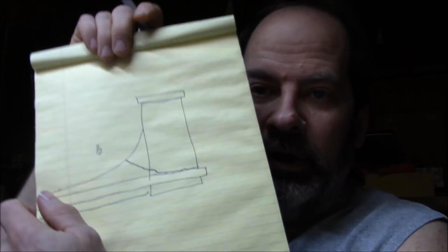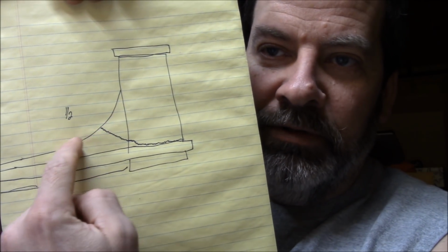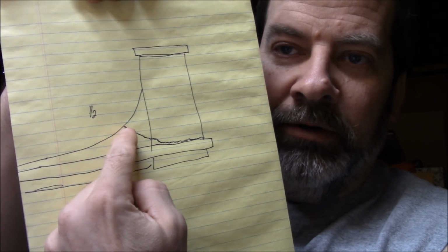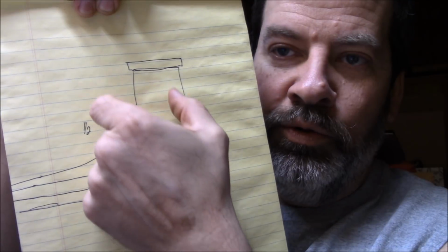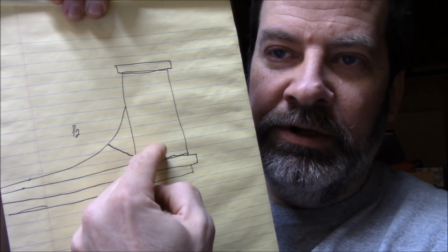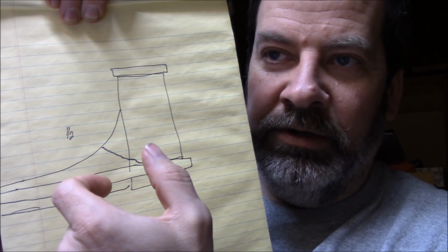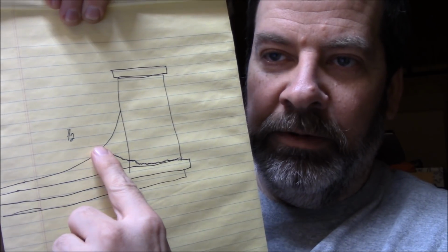The crack that I'm looking at on that particular knife, and I drew a little picture of the knife. The crack, you can see, goes, this is the vertical section or the knife edge. Okay? And the crack was clean through here, and this is the tube which has the shaft and the bushings. On the opposite side there's the grease fitting. So this is pivoting on the shaft that holds the feed roller arm and the knife, and it's typical.